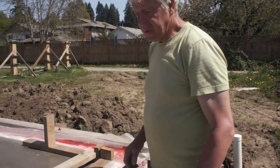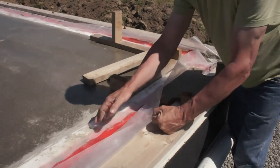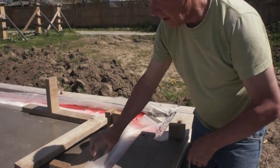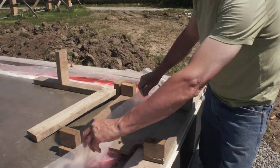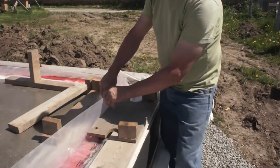We are going to start framing the wall. The slab is over here, we have eight inches of foam, then the concrete wall. What we are going to do is a double stud wall — a separate plate on top of the slab on the extreme exterior. The vapor barrier will come up about two-thirds in. There will be rock wool insulation on the exterior stud bay and rock wool insulation on the interior stud bay as well.